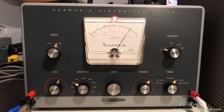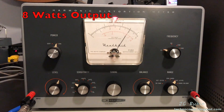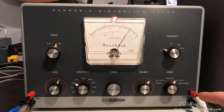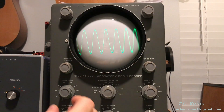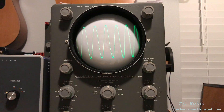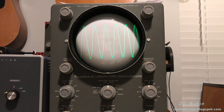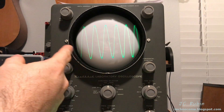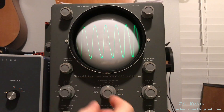We can see that I currently have it on the voltage setting in the 10 volt range. It's reading about 7.9 volts RMS — I've also verified this to be correct. This is the amplified signal coming out of the ST70. It's coming in on this jack from the amplifier and then going out on this jack to the oscilloscope for viewing. The oscilloscope is not required for any of this — it's optional. With the input plugged into the oscilloscope, we're currently looking at the input signal passing through in the set level and voltmeter position, with no filtering of any kind going on in the harmonic distortion meter.